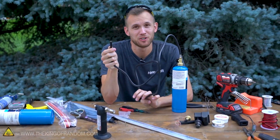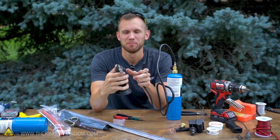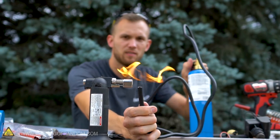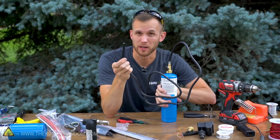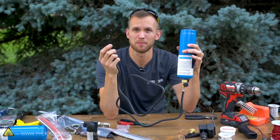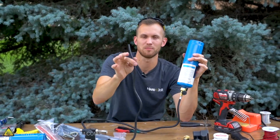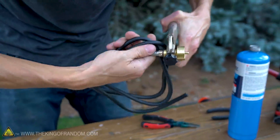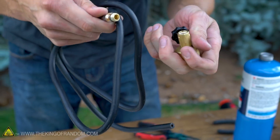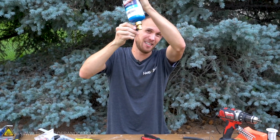Now that I've disabled the valve, I'm going to do something that's not very safe — I'm just going to show you that there is propane flowing out of here by blowing it right onto an open flame. You can see that propane lights on fire. We can see propane is now flowing out this tube, and we actually want propane liquid, not propane gas — and the key to that is basically turning this upside down. But we've got so much tube with heat in it that it just keeps evaporating the propane, so it still comes out as gas. We need to modify the valve itself so we have a much higher volume of propane dumping out. That way, even if it passes through some tube, we'll still get liquid spraying. With the modified valve just opening directly, if I turn it upside down, we can actually see some of the liquid propane — and that is what we want more of.